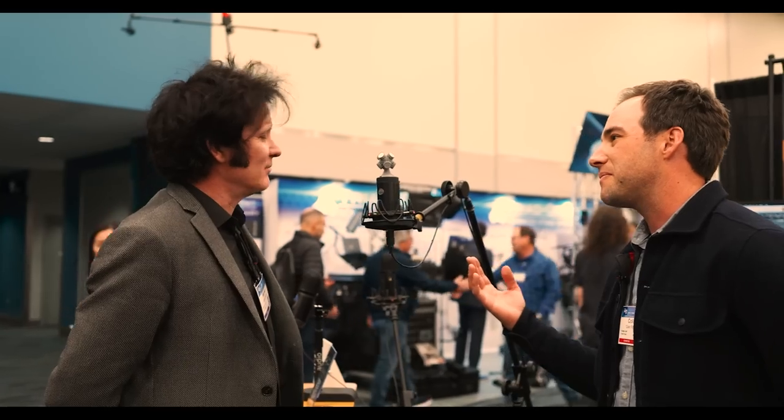We're with Colin at Voyage Audio, and he's going to tell us about this ambisonic microphone that he designed. What we have here is an eight-capsule microphone doing second order ambisonics. What's the difference? Second order ambisonics captures the sound field more precisely and enables higher order pattern control. With a first order ambisonic mic you can roughly create a cardioid pattern, but with a higher order mic you can create a tighter pattern and do Dolby Atmos with a lot more realism.